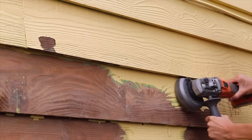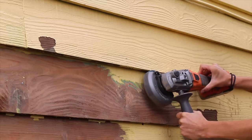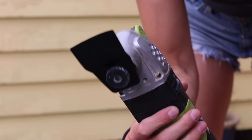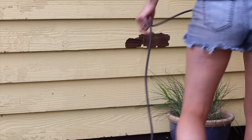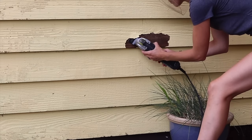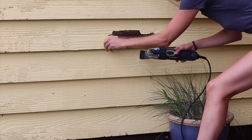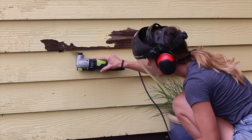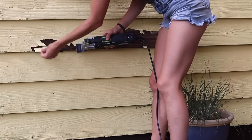I found the most useful method for this particular tool was to go underneath each lap. The diamond brush made quick work of removing the paint along the front face of each lap, but these sponges could carefully get underneath the lap and in between to remove the rest of the paint. Now let's test a glorified scraper — this is a scraper blade attachment on my oscillating multi-tool. This is going to work in my application because my paint is peeling off the wood. As long as I can get the scraper blade behind the paint it's going to peel up just fine, but if yours is chipping rather than peeling then I can't imagine this is going to work super well. It does gouge the wood somewhat so you would definitely still have to sand afterwards. But this method is really good for getting into tight spaces and on the underside of the lap in areas where the diamond brush and sanding sponge can't reach.